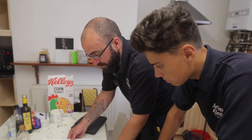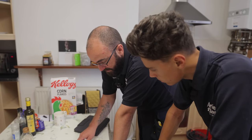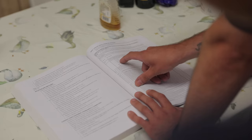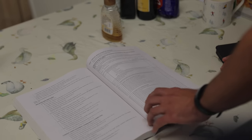So if we do a bit of that today, let's do section 3. You can check out the reg numbers and we can find out what is supposed to be there and what is the minimum standard, and we'll go through the inspections together. Earthing arrangement, meter tails, metering equipment and isolator, whether present. And we need to code whatever we find. So let's go and have a look at that.